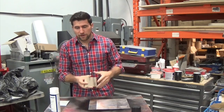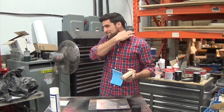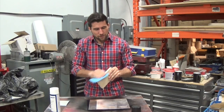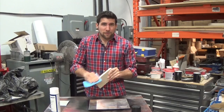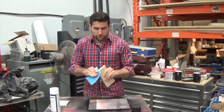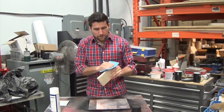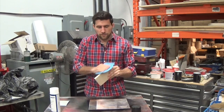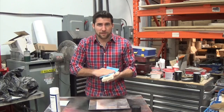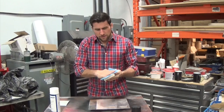Now I'm going to hit it again with 400 grit. 400 is very fine for woodworking — it's a finishing paper, so you tend to use it mostly just to sand finishes. It doesn't hurt to get this a little bit smoother, and 400 tends to be a reasonable starting point when you're doing painting. I also like to use 600 on a lot of stuff, but here we're going to have to seal this up a lot anyway, so there's really no need for that.